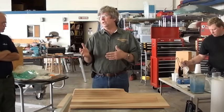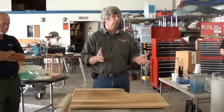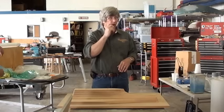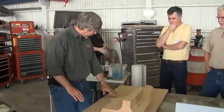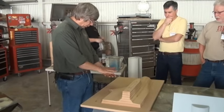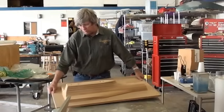And I can't tell you how many people have actually had an experimental part. They needed a fairing or something, or a bubble on the cowling to fit some piece of equipment. You can make this stuff up. We just happen to be using a CNC router, and we're cutting out single layers of MDF, and we get them up to the point where we're gluing them all together, and that starts our basic shape. And then after we've got that, we go to the next stage.